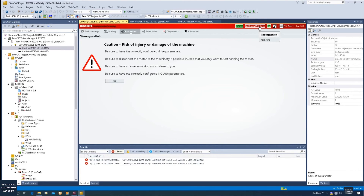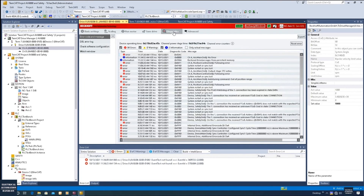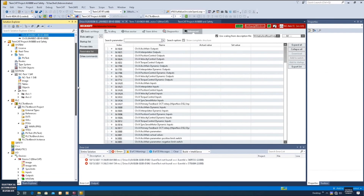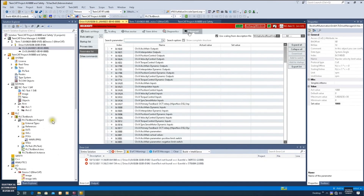The system now shows Ready, however the drive is currently blocked by the safety system — the STO (Safe Torque Off) mode. Let's briefly review. In this video we used the Scan function to read the actual topology and hardware configuration. We have two EtherCAT stations: one EK1100 coupler with safety modules and signal modules, and the AX8000 drive with two motors and two automatically created NC axes.